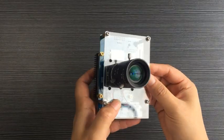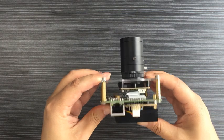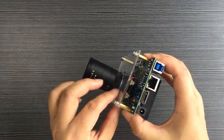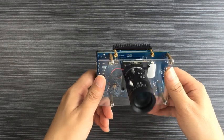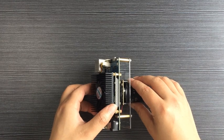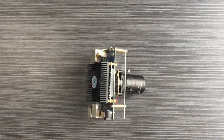That is our newly released Vision Edge Computing Platform, shortened as the VECP Starter Kit. The kit perfectly combines the ISP core and hardware platform based on Xilinx ZYNQ UltraScale ZU3EG MPSoC. It is able to handle 4K video at 30fps with an ultra-low delay video transmission at maximum 0.7ms.